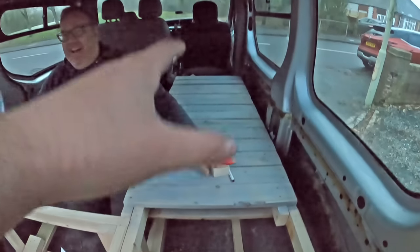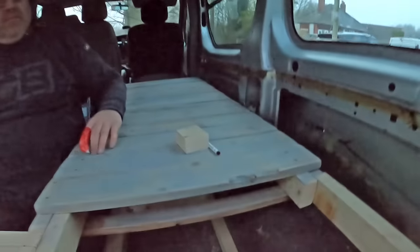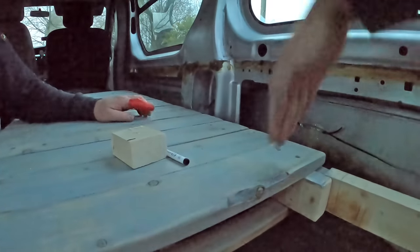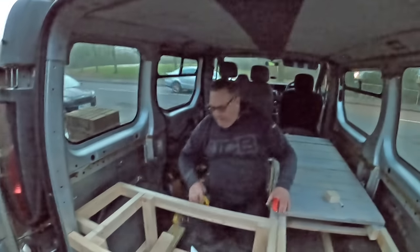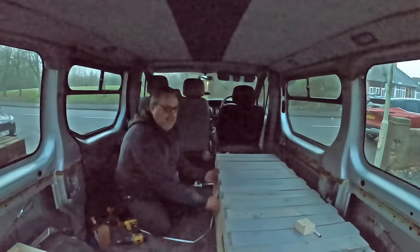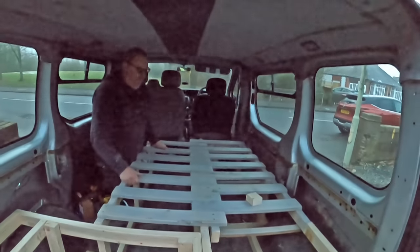The reason this is a slightly different colour is we've used Brywax. The issues we were having over the last couple of weekends trying to get this sliding mechanism working — it wasn't quite working. What we did was dig into the bed and wood to give the sliding slats a gap to sit properly because they were catching. Then we did more chamfering, more sanding, and we've now got a nice slide-out bed. Give us a demonstration, Steve. He says: I don't care if you're an experienced joiner, this has been a nightmare. Oh look at that — beautiful. Now we've done all the chamfering, put the wax on, sanded it down, put more wax on — it makes for a nice slide-out bed. I haven't got to fight against it every single night.